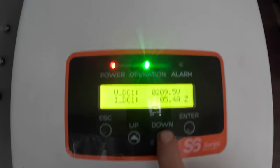That's a tiny little flow rate doing 500 watts. It's very efficient — it just gets less efficient as you get up towards its peak design output. It's happiest at around a kilowatt. It will run fine at 1600 watts but it just uses a lot more water. It shows this wheel will work really efficiently down to very low flow rates — that's good.